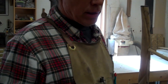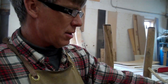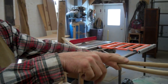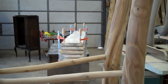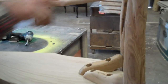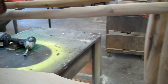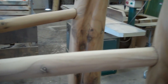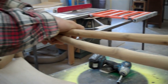I'm going to glue the legs onto the underside of the table top and also glue these cross members, or rungs, diagonally across. I need everything to be dry fit pretty much exactly where it's going to go. I've made some tiny punch marks so I get these rungs in exactly the right location — they'll twist a little bit, and if I don't get them in the right place the center area won't line up correctly.